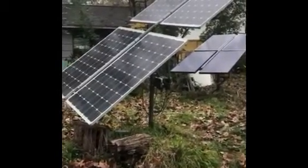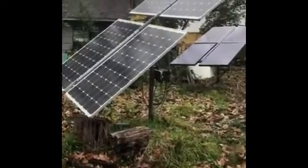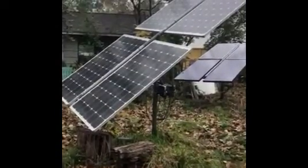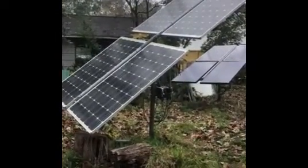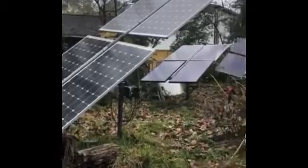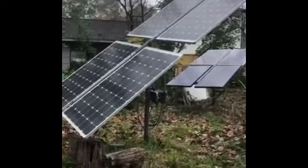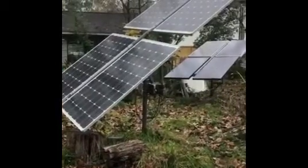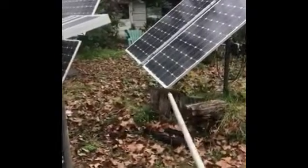So this is a four-panel array, and I talk about it as a modified two-axis. That is, there's one motor, but there's a manual adjustment to tilt the array for wintertime or summertime. Right now it's tilted at a rather steep angle for the winter sun. When I compare this to the one in the distance, it's somewhat higher in the sky, and wind loads are always an issue. The reason this is so high is to avoid the bottom corner of the panels hitting the ground when it's adjusted for wintertime.